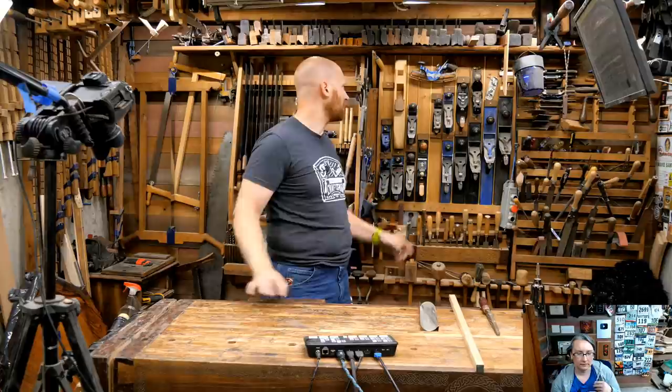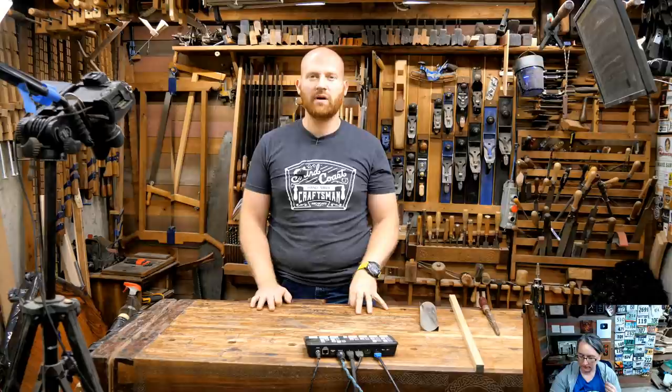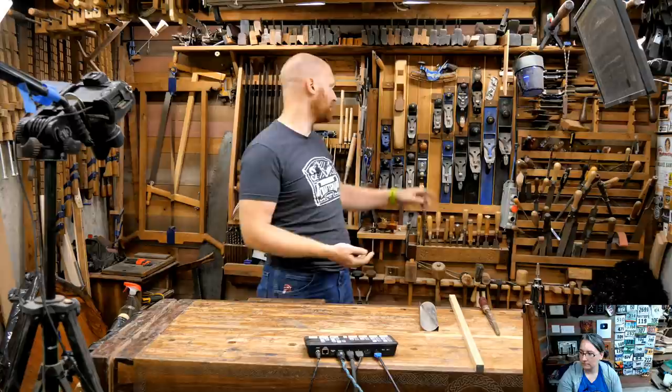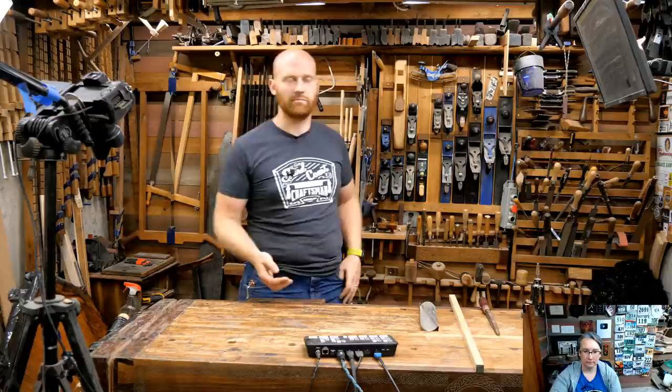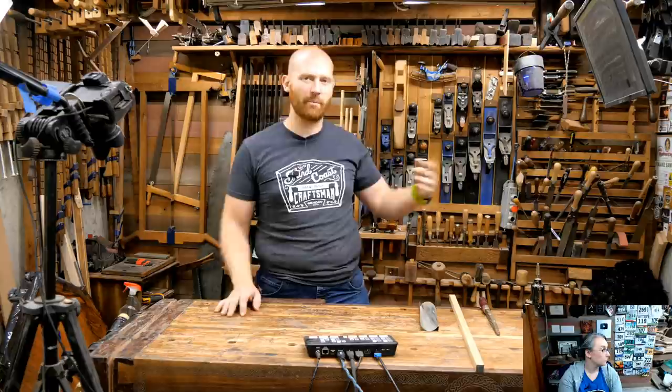Yeah, when you're actually getting into old style irons, I'm probably going to buy an old plane that's beat up and then steal the iron from it. That's the way I'm usually going to go because it's the cheapest route. But there's nothing saying that you can't go and buy one of the new irons from one of the manufacturers such as Hock or Veritas and actually get one of theirs with the chip breaker and put it in, and it works just the same. I don't know if there are any new makers that sell old style iron and chip breaker combos. That'd be interesting. I'll have to look that up. But normally I would go and buy one for a metal body plane, or I would buy a wooden body plane that's beyond use and steal the iron from it.